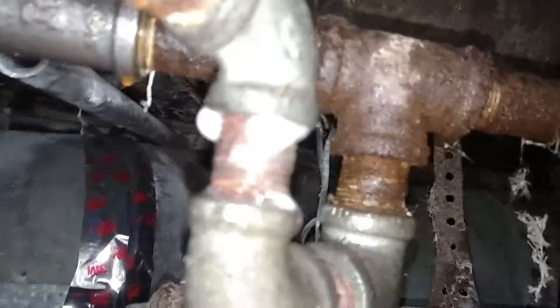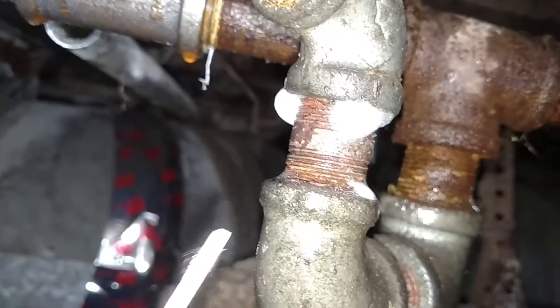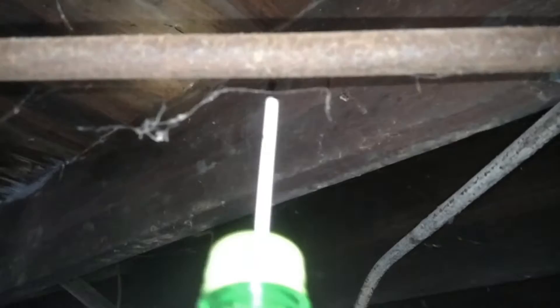You can see how small it is — it's just now starting to come back where I doused it a while ago. I'm going to have to split this pipe right here. I'm about to cut it, thread it, and put a union in between here so I can get in there to fix it. This is threaded back over to the other side, so there's no way to unscrew it — if you try to unscrew this left it actually tightens it into that one. So it's got to be cut and you've got to put a union in somewhere, probably right about here.